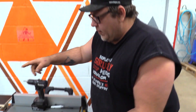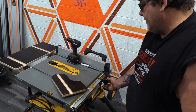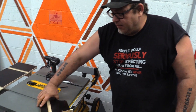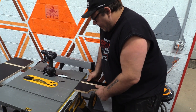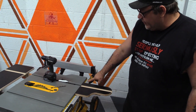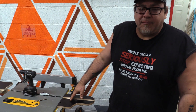Now, if you're one of the people that ordered the outfeed table, the outfeed table does work with the fence in place, so you can leave the outfeed table on all the time while you're moving your fence position. The fence does not work with the infeed table — so once you clamp this in place, the fence will not move. You can go all the way up to here, so you'll have about three inches there and then some more, but if you're cutting anything really narrow, you can't use the infeed table for that.